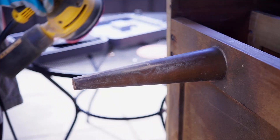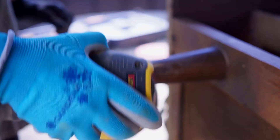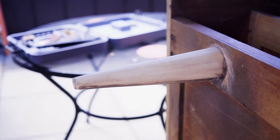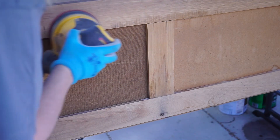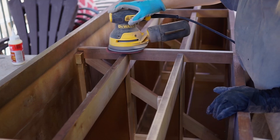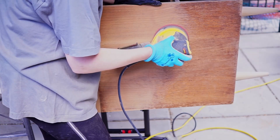If you're wondering why I didn't take off the legs for sanding — they were sitting pretty good, glued to the base, so I couldn't, and there was no reason to. I sanded them just like that, no problem. Usually I don't sand the bottom of pieces, but this wood was pretty rough — the manufacturer left it like that. I didn't like it, so I sanded it smooth with 220-grit sandpaper. And of course there was more sanding, more sanding, and more sanding.